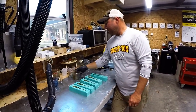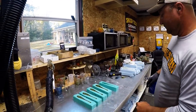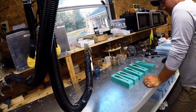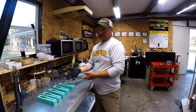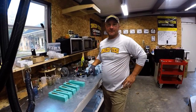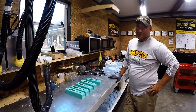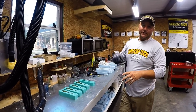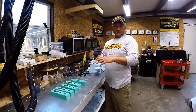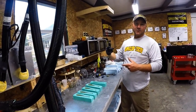That was pretty close — hadn't done a small batch in a while. Now, when you've got these molds lined up, it's another several minutes before they're cool enough to take out of the mold — that just adds to the time. Hand pours are a very time-consuming process. A lot of the baits you can get are injection baits — machine molds. They shoot them in there in a big factory; they've actually got liquid running through their molds to cool them, so the baits cool a lot faster.